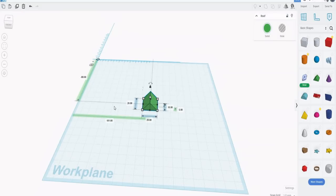Now if we click on that, we can see the coordinate to the midpoint. If we change that to use endpoint, the coordinates will change. The coordinates are taken from that point there, and we can read different coordinates. Those two tools are going to be immensely useful for placing accurate geometry. So, 3 bits of information. The ruler tool to measure a couple of things, the plane tool so that we can change our perspective, and that little thing about dividing 180 by the number of slots so we know what the angle is. Armed with those 3 bits of information, we can now set out to draw this.